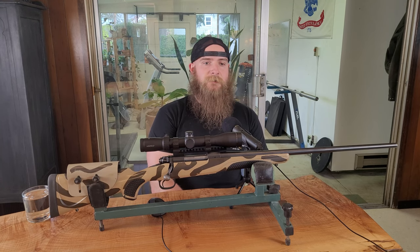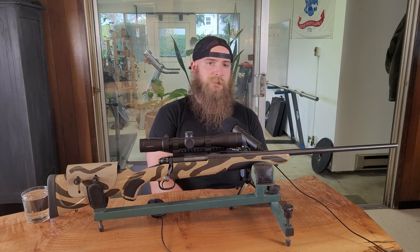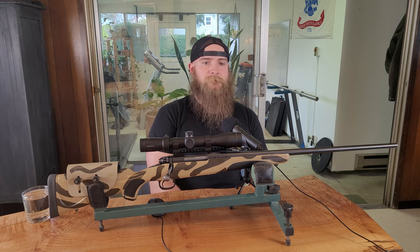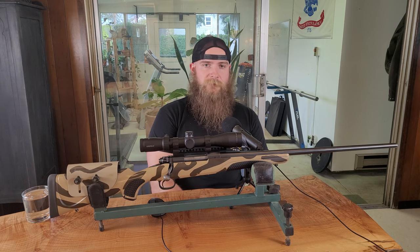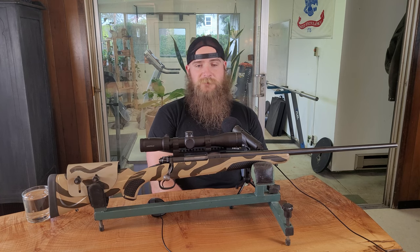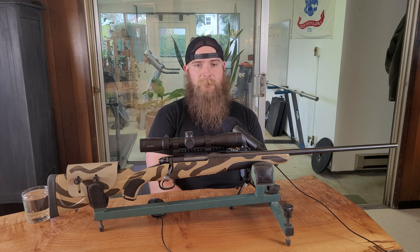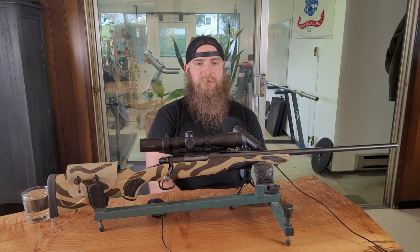The two possible causes I identified were a slightly bent firing pin and a spot of bare, non-treated metal where the cocking piece engages the sear. I took the rifle to a gunsmith, and he confirmed that the firing pin was slightly bent and straightened it back out a bit, then we tried to fire a primed case — click, no bang. After looking more closely at the cocking piece, we concluded that either material had broken off the shelf on the cocking piece, or someone had removed some material from it, potentially for a ghetto basement trigger job to reduce the travel time of the pin.